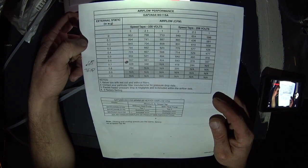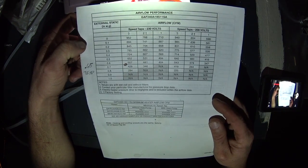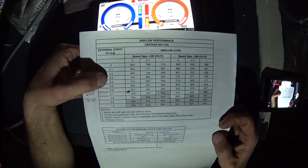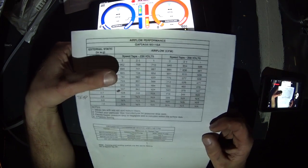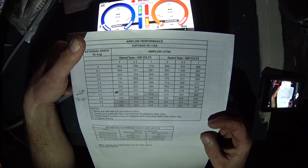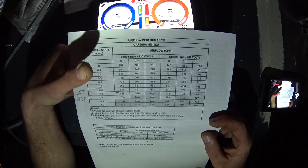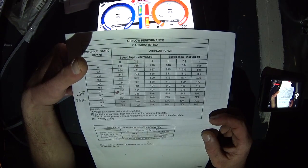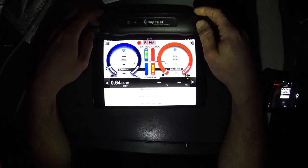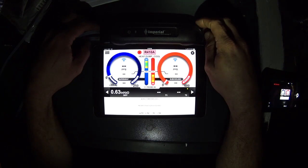So we're going to try to knock it down and try to get closer to the nominal 800. If we could get it down to 0.3, we'd have 785 CFM for this ton and a half. 557 really isn't bad, but what we're trying to improve here is the duct noise and register noise. I'm going to pull the two runs that go to the master bedroom off of the plenum and see how that changes our duct noise problems.